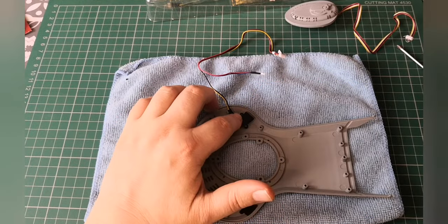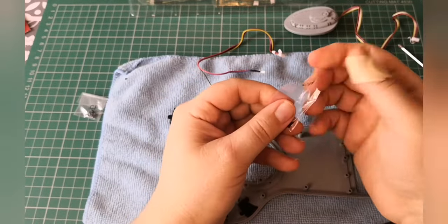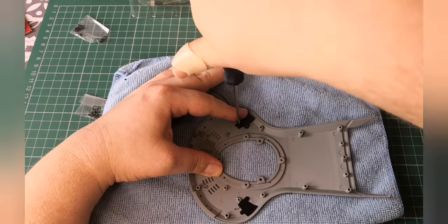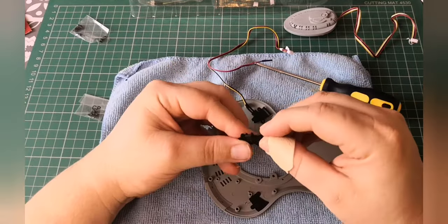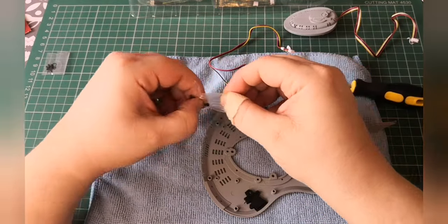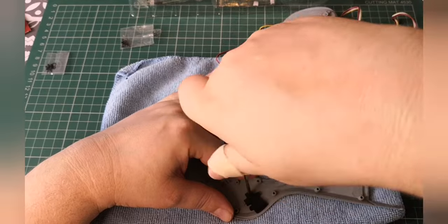Now it's asking us to put a CM screw in there, so we need the CM screw - we've got a CP-CM pack. Just in the top section. Once there's a little bit of tension, stop. Now on the right side we're not fitting the light - we're just fitting this unit, so we just need another CM screw. Make sure you get the right screws. This one goes in this side.